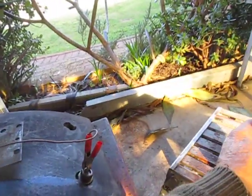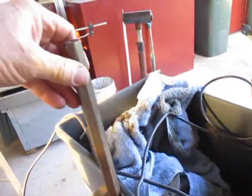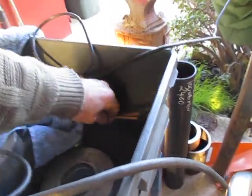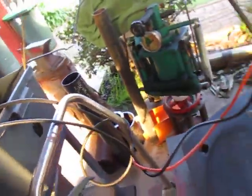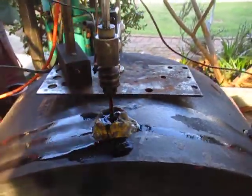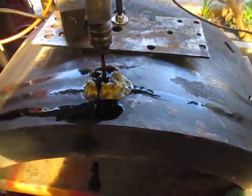So at the moment we're still advancing. Quite often I will do this work inside this bath - if it's a small piece I'll fit it into the bath here and on this rod I'll fit the head. And here are some pieces of copper and brass that I make electrodes out of and machine them to suit the different depths and everything else. So anything more than this is just going to be boring - we'll just carry on and if anything interesting comes up, we'll return.